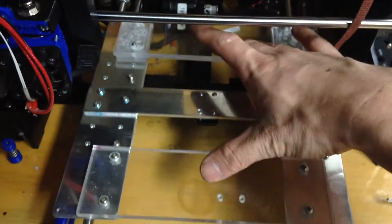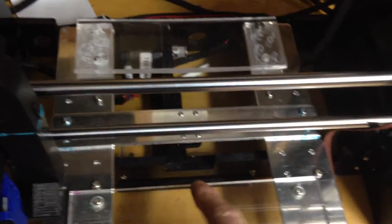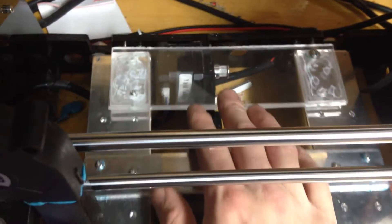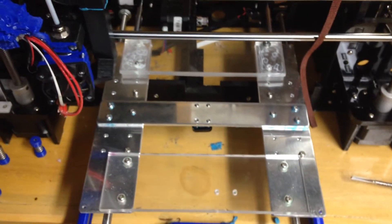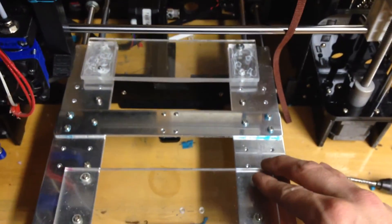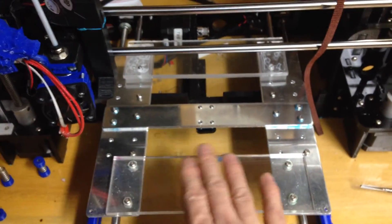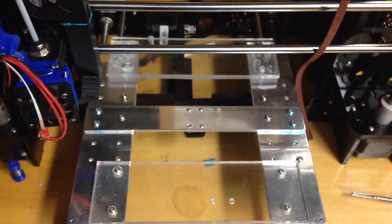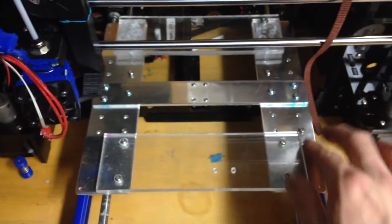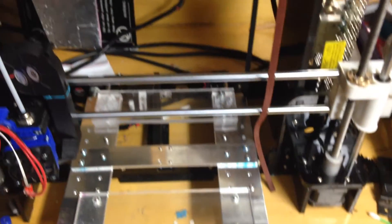This gives support here now, and I'm sure that's why they didn't make it square from the factory - less money, and they probably didn't account for the extruder being in the way. If you have plexiglass lying around, use it - it's probably stronger and it's not going to melt in the heat as easily as filament. I put the file up there so you have the idea, and I also put the vectors up so if you want to machine the same shape profile you can.